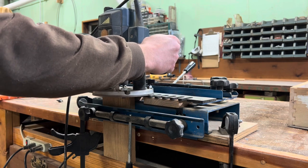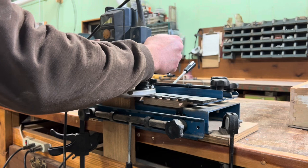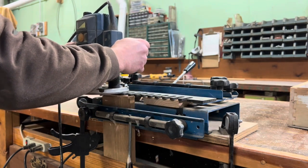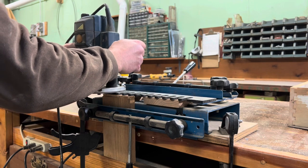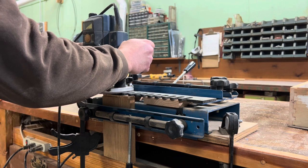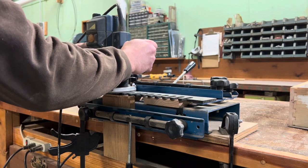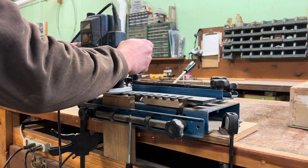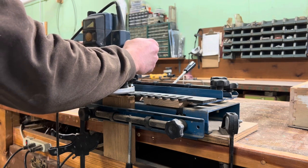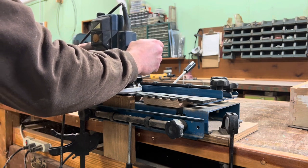One thing that I noted is that oak cuts a lot harder than pine does, which makes sense because oak is a harder material. I went ahead and scored the face of the piece so that I would minimize the tearout in the pins. Then I went ahead and made a rough pass and went back and made a finishing pass. You're plowing out a lot of material when you first go into a piece like this, so making a finishing pass is a good idea. It takes the stress off the cutting tool as well as the material you're cutting and will give you much more accurate results.